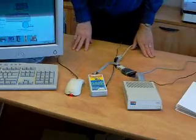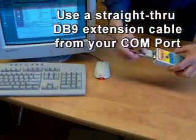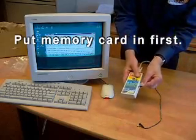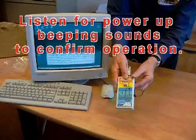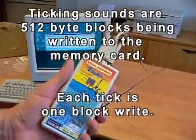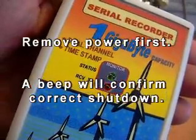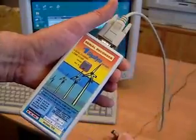Here we attach to a PC COM port to test the unit. The ticking sound is like data writing to a disk drive — it helps give you assurance that the card is being written to. Each tick is produced after a block of data is written to the card. Remember to remove the power before removing the card.